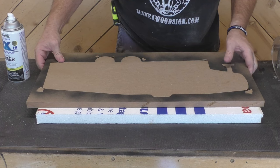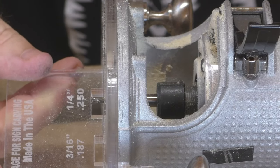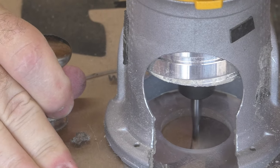When you're cutting all the way through a piece, you want to make sure to have something underneath that the router bit isn't going to damage. Dad likes using this foam because there's less resistance on the router bit as you're going through.